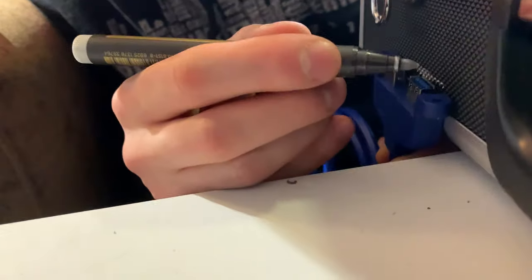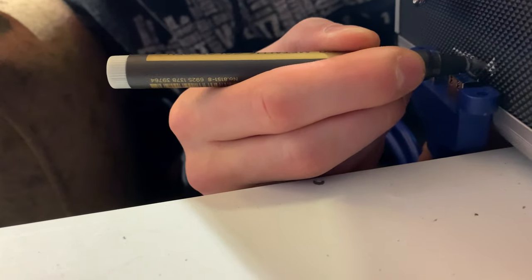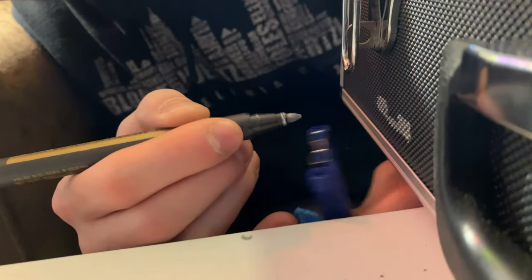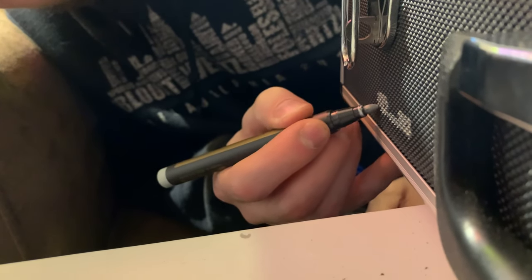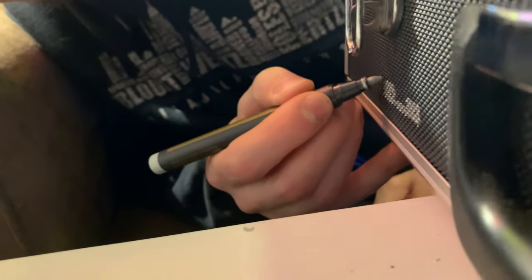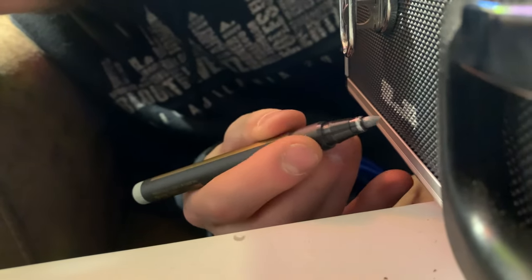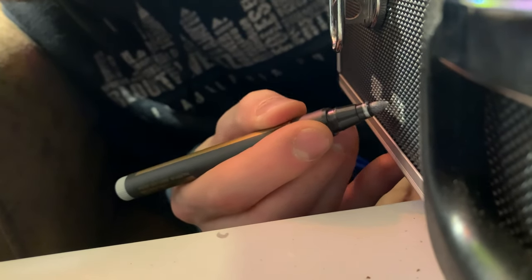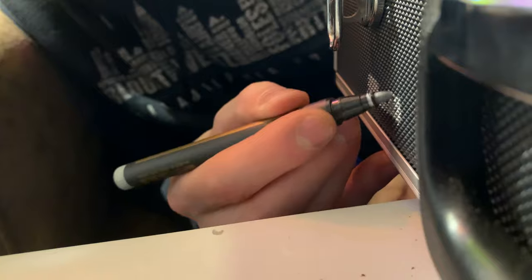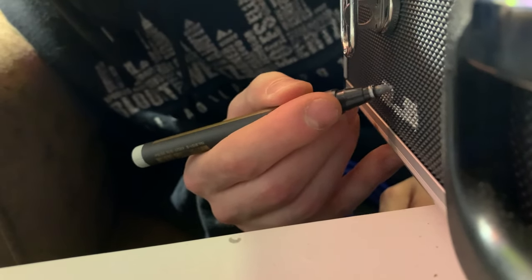All you have to do is use the Dremel to get most of the way across, so you could probably sand in the remainder of it. You won't even have to use the Dremel. You can use the power drill and just drill holes that are exactly the width that you want and then sand it down. Or use the Dremel to clean out the edges if it's easier than using sandpaper. So you could get most of that material out just using a wider bit. Probably two drills.